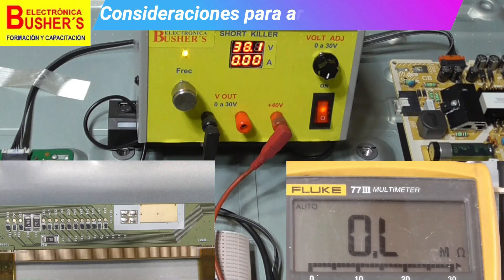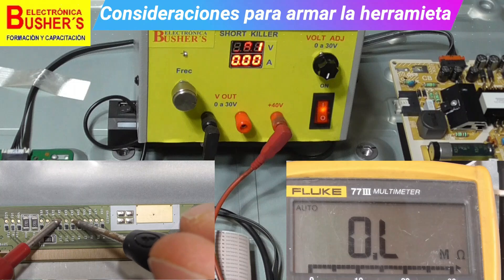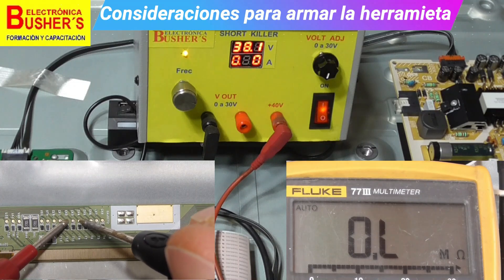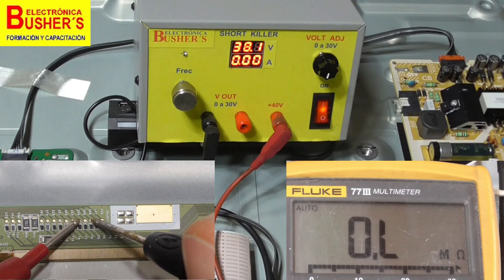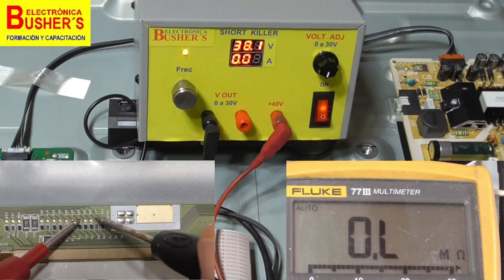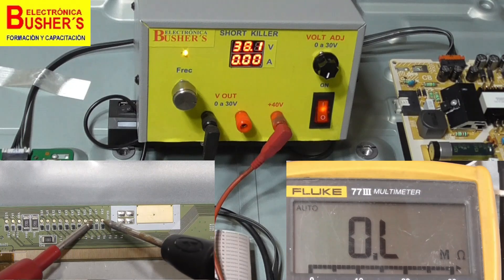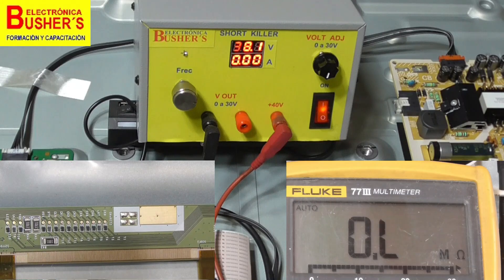We will review the situation that generated this conflict and measure the CK signals. Here we see the CK1 signal relative to CK3 shows high impedance, CK2 to CK4 high impedance, CK3 to CK5 high impedance, CK4 to CK6 high impedance, CK5 to CK7 high impedance, and CK6 to CK8 shows 1 megaohm and decreasing.